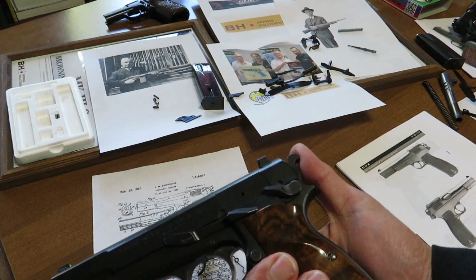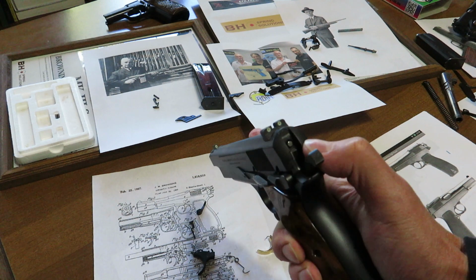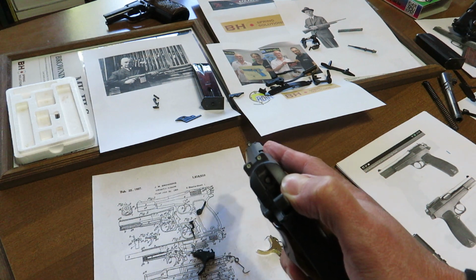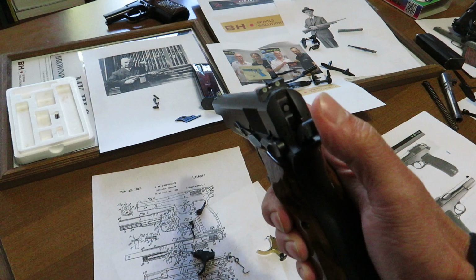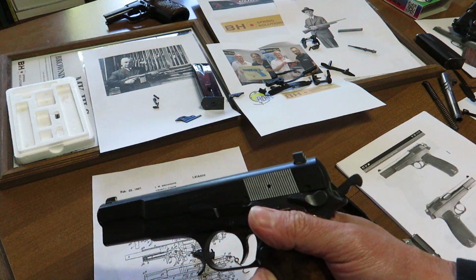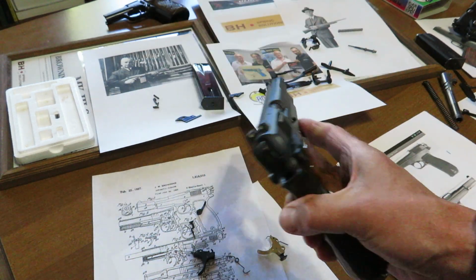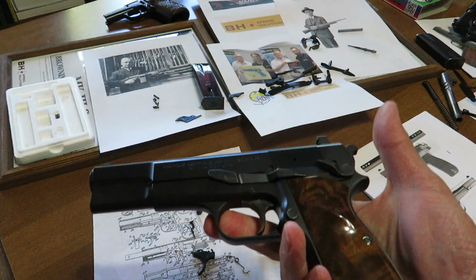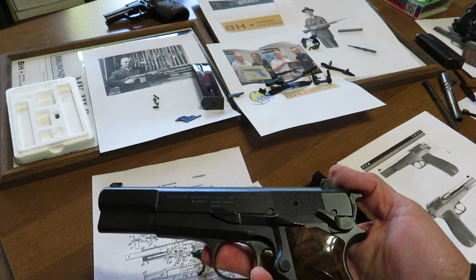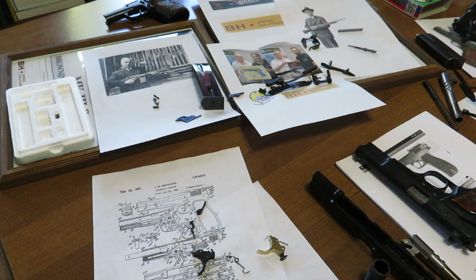One other thing about the SFS system also that Leon also did for the design is the SFS system has an additional drop safety part, and it's right there just below the firing pin. And it may or may not be able to be seen, but that's blocking the hammer to the firing pin, and it won't allow the hammer to go to the firing pin until the trigger is pulled. And that restored an affirmative mechanical hammer drop safety that, again, the 1927 Grand Rendement would have been drop safe, muzzle or hammer style drop. The SFS system was another, again, with the drop safety part, was another restoration of John Browning's original characteristics of the 1927 Grand Rendement.